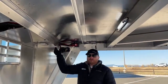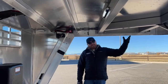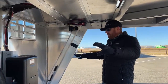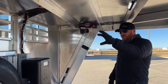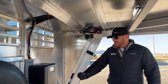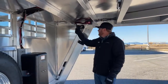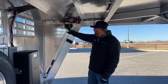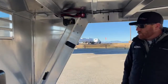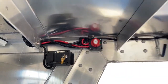He also wanted a light underneath this gooseneck. Typically your cab light is actually blocked by the front of the trailer, so this light works to illuminate everything back here — operating your air ride, taking the spare off, messing with the jack, or the generator. You have some light coverage back here. The switch is right over here by the controls for the hydraulic jack. We also have a battery disconnect up there, so if we need to kill all power to this trailer, I just reach up here and turn that off.